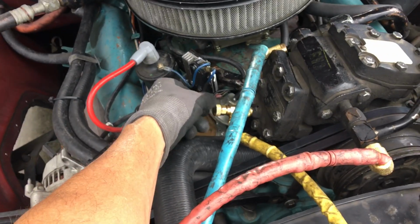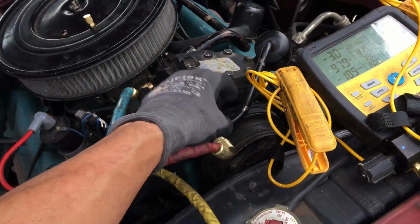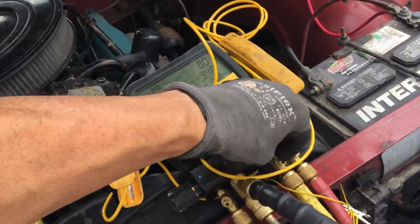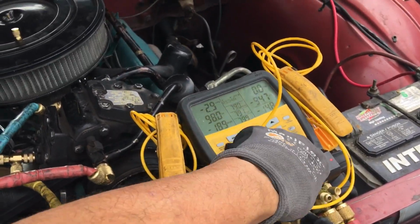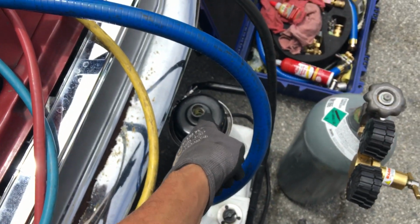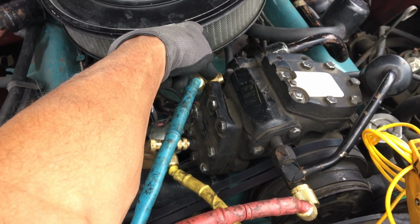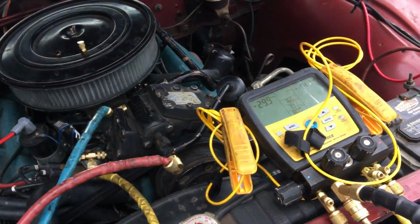Okay, so this depressor is all the way down now. This is on, this is on. Every fitting has NYLOG. Everything is tight. I have the high side closed right here. I have this port. I just want to draw a low side right now. And let's open the vacuum. And now I just opened the vacuum. And you hear and you see barely any flow coming through this because this Schrader valve is still inside here, plus this low loss fitting is so restrictive, it slows the flow of vapor coming down there.